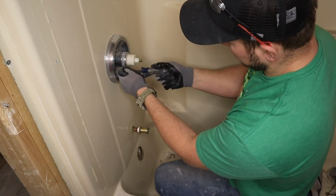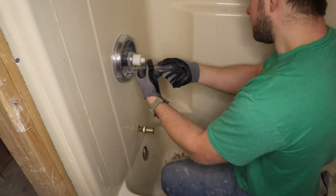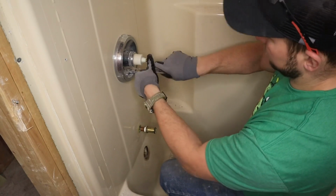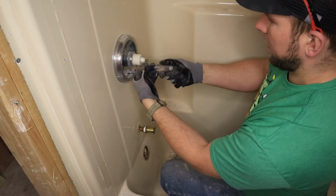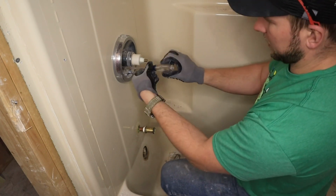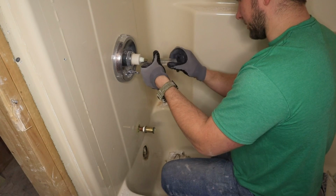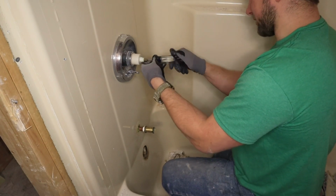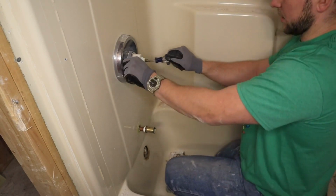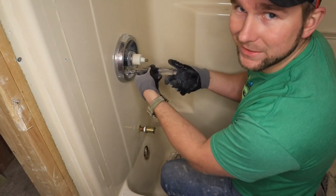And this guy, two little screws here, both sides. If you have a drill, you can use a drill too. So next, after this comes out, we're going to get our pry bar. There's still some nails that hold the tub basically in place. We're going to pop the suckers out. And then we're going to Sawzall the crap out of this tub.